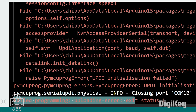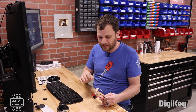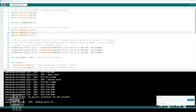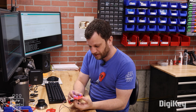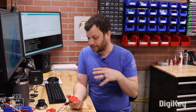Failed uploading — upload error, exit status one. I thought I was going to get lucky and have it work right off the bat, but it never goes that way. So I did my homework and read the datasheet. After going through the documentation for the programmer and the chip, I found a couple of settings I had missed in the Arduino menu, and I also made sure all the pins on the microcontroller had good solder joints. I hit upload again — and it succeeded! Turning the board over, you can see the LED animation I wrote is working: it blinks one LED on each branch in a different color — red, green, blue. I'm glad that wasn't a big issue, and now I have the confidence to start assembling more of these boards.